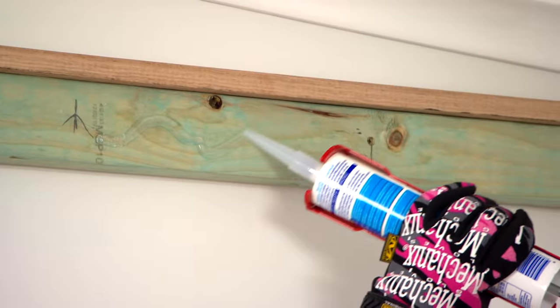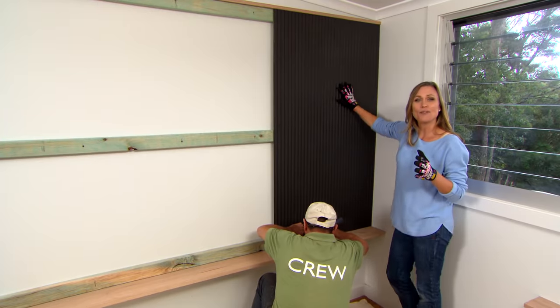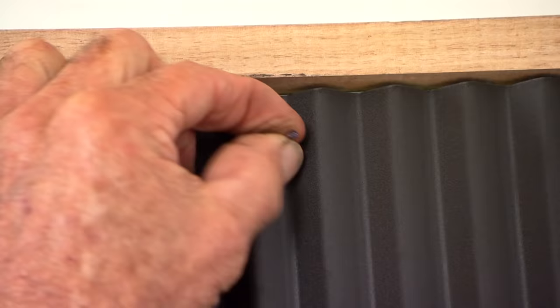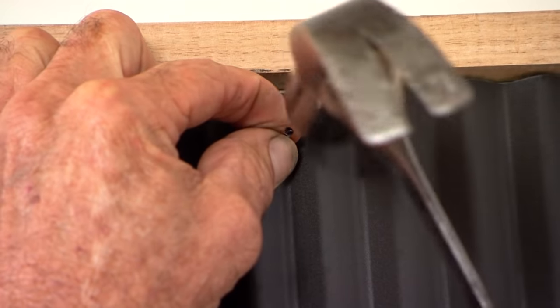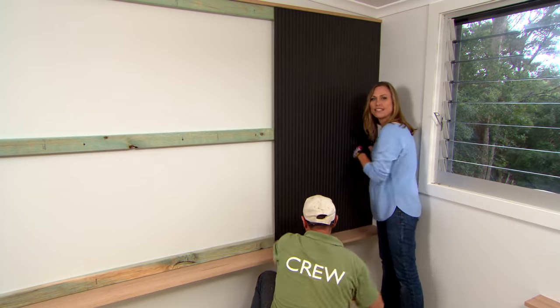What we've done is put a clear glue top, middle and bottom. The secret with this is not to have too many visible fixings — just a couple of very small flat-head nails at the top and on the bottom, trying to keep the middle nice and clean.